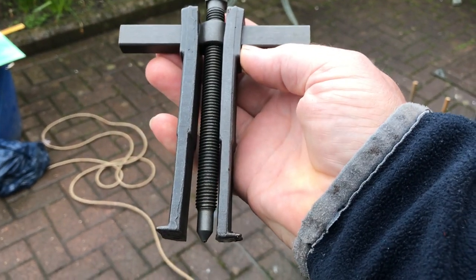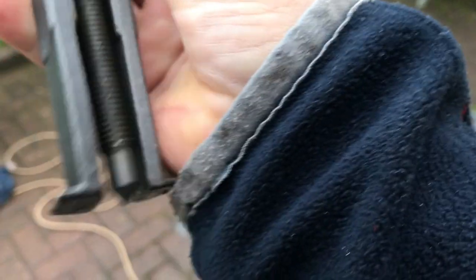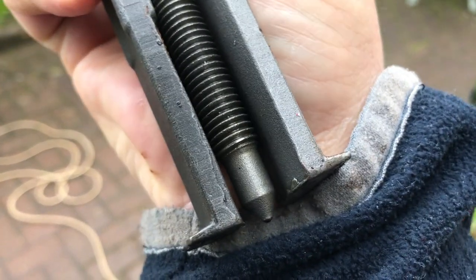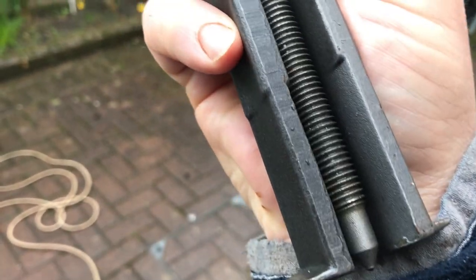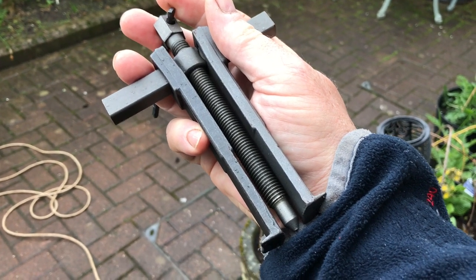Right, so we've got a set of forged bearing pullers with very thin toes - let's have a quick look at them. These are six inch bearing pullers, which means six inches from the screw to the toe. They've got a very thin toe which allowed us to get underneath the lip on the inner bearings in that casting and pull them out. The first bearing was a little bit tight, not very tight but you knew you were pulling it. The second bearing was so slack that I put my finger on the rim when turning the spanner just to make sure the legs hadn't popped out from underneath - that's how free it was.